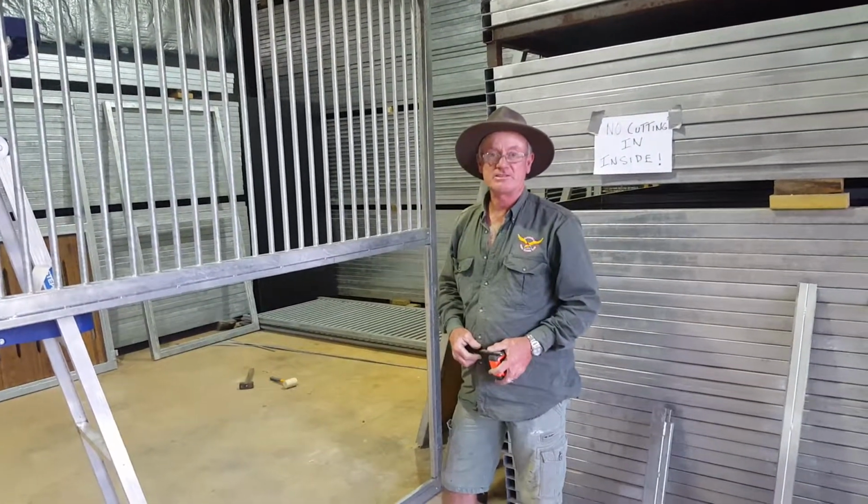Now, inside this, it depends on what your panel is. If you've got Tassie Oak, bamboo, ply, whatever, we'll make up the doors, and we'll supply the hinges, and we'll supply the locks and everything for you to install. You just need to remember that measurement, 650, it will be on the instructions, and 475. Cut them off.